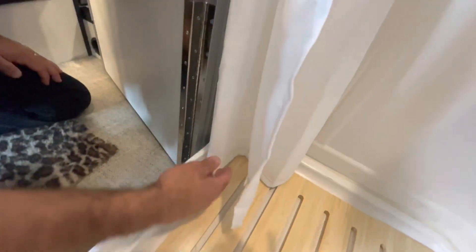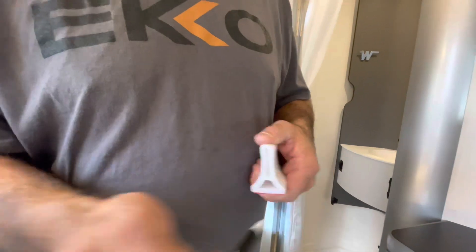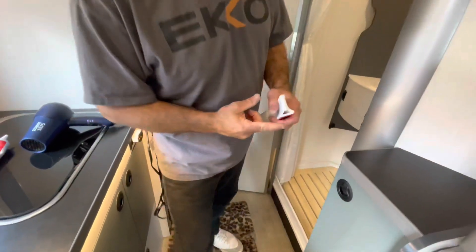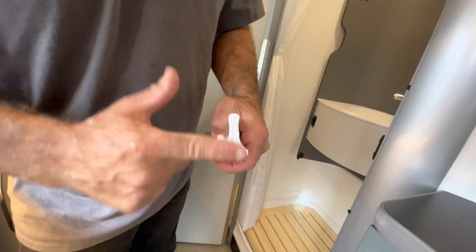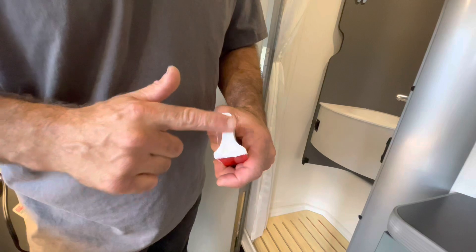As you can see, our shower curtain now - we don't even have to worry about where that's making contact. I'm pretty happy with that. Now, some of you paying attention at the beginning might ask: what about water or debris collecting in the gap? Good concern. After the dam is set - I'm just demonstrating now - I'm going to run a nice clean bead of silicone caulking right here over the openings. I squeeze some in there on the lower part and make a nice clean seal.